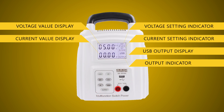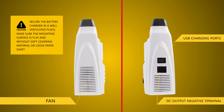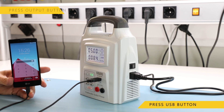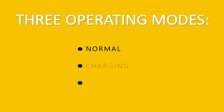The AX3010H is a portable medium output switched power supply with digital setting parameters up to 300 watts. It has one output with full digital control over the entire capacity rating and a 5 volt DC connection via USB-A port with automatic detection of connected devices. The power supply has three operating modes: normal, charging, and USB mode.